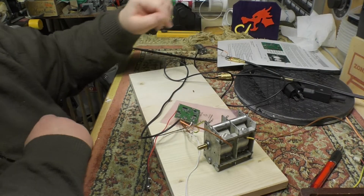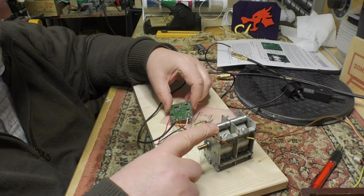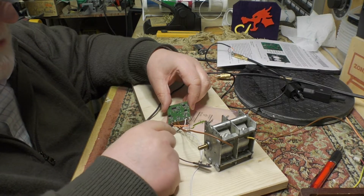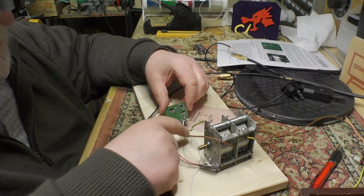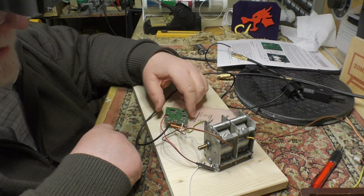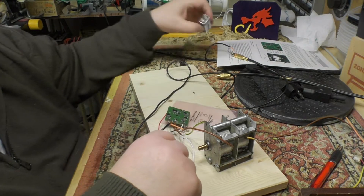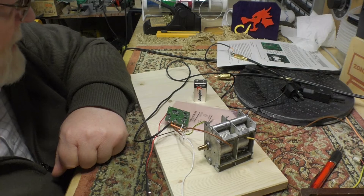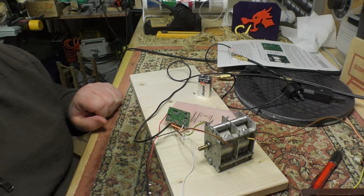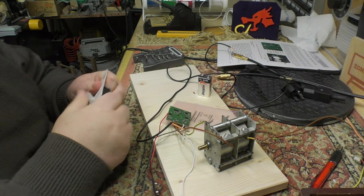Okay, so battery connector here, audio out screen going off to the bench amp, tuning cap connected in, and there's an AM/FM switch — to go into FM mode you just ground it, so I've grounded it. That's it for testing purposes, although it's upside down for doing calibration. One slight problem: the battery looks discharged, definitely not eight volts. Need to find one with more life. Success — we have a new battery, if we can ever get it out of the packaging.